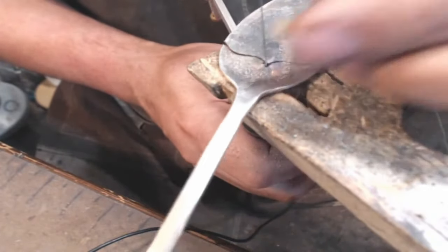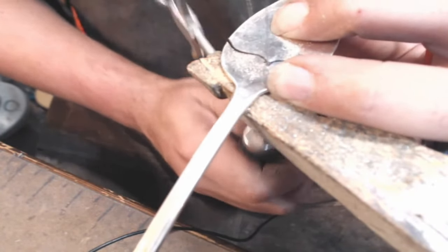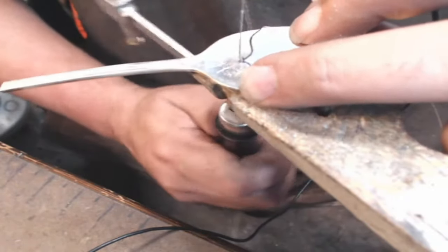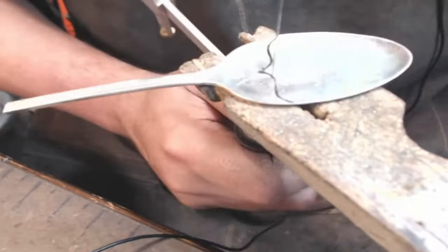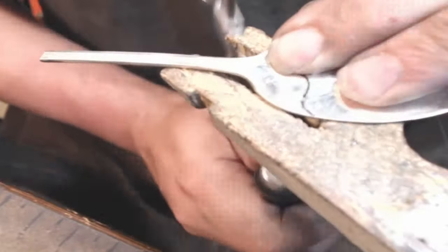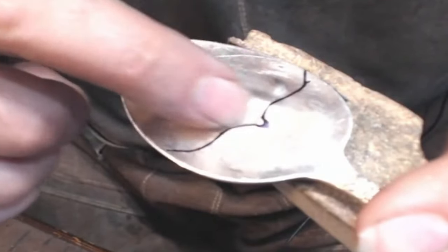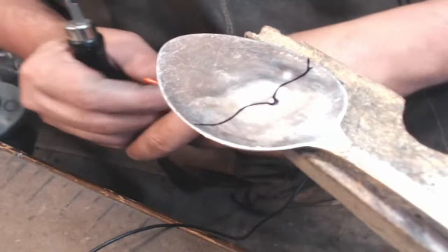If you have the chance go ahead and wax your blade. I'm pulling it backwards just enough to get the teeth not to catch as I turn, and you'll feel and hear one of the teeth start to grab. Once that happens you can get the blade where you want it and off we go. Another pretty whale tail. On the big guys you can see how it's rippled - there's only a little of that rippling that goes up into here and most of that we can get out when we finish the piece up.